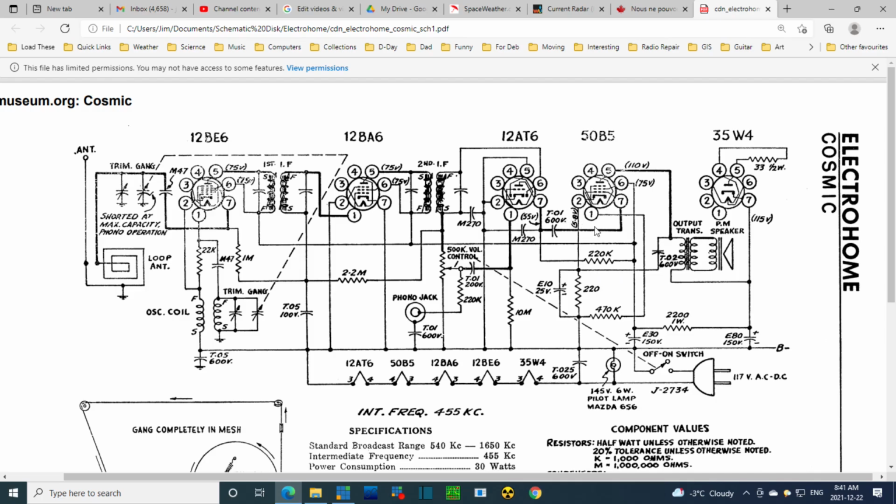Well, I tested this voltage here after changing this capacitor, or this capacitor and this resistor, and I got this exactly right, 5.8 volts. Hard to believe it's being pushed there by some leak from here. But this is in the audio circuits, so something is causing it to be distorted. Another good possibility is it's one of these tubes that's doing that too. But we're doing capacitors right now, so let's carry on with that. So here's one. Maybe if I change this, the distortion will go away.